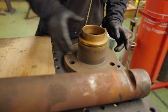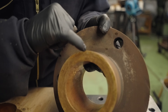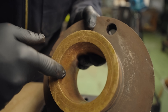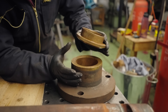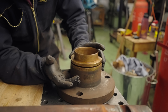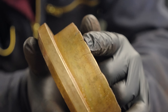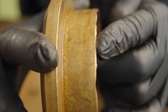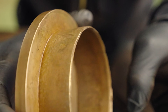Let's have a little examination here. Obviously we know that's our ram — it goes through these two components. This bolts into there. Now here's something I noticed: there is a little hairline crack running through the bronze. It would appear there is a push-fit bronze bushing that's been squeezed in there, which provides a nice slippery surface for the ram to slide on. When that's bolted in, there is this additional little collar that also lives inside the cylinder. It also has some little hairline fractures — maybe nothing to worry about, but actually, no, that's got a lot of them. One, two, three, four, five, six, seven, eight, nine, ten, eleven. I lost count of where the start is.